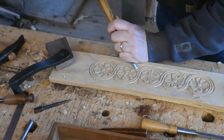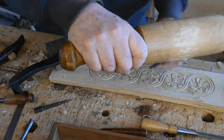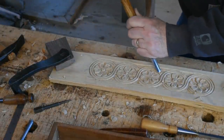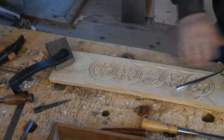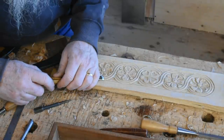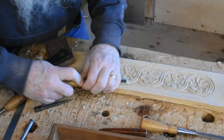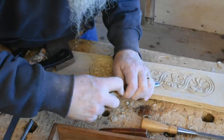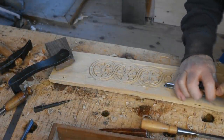The bevel that creates that little mock woven effect there. You can do that before or after rounding that off. Oops. That's a little bit of stuff hung on there. And now when I round this, I'll do all the ones from this position. See, I go right to the next circle. I'll finish that one off. And that's the way all of these repeating patterns get cut, is you do them all in succession. Makes it a lot faster.